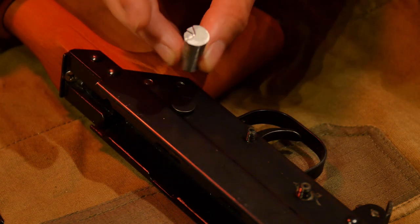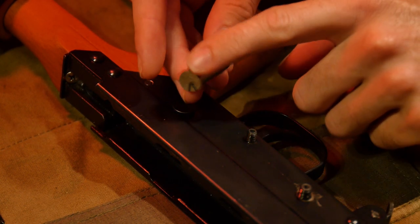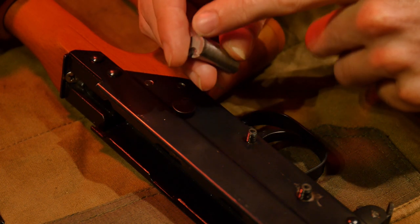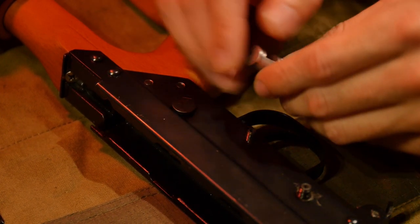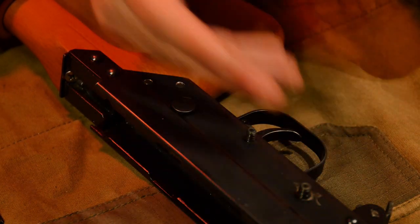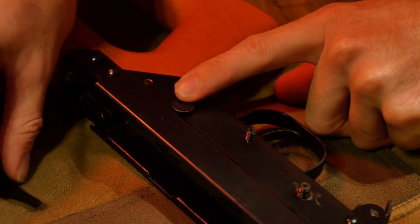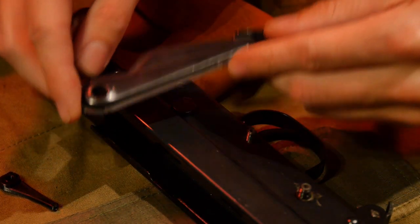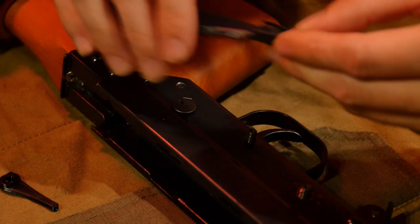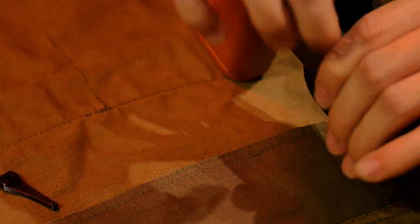That's what I've done on my Type 81 SR here. We're going to be switching to a prototype cam that I've been running on my SR for quite a while — and I'll show you the modification I did to it. I took my time and was able to remove the material in a way that makes it interlock with this radius perfectly, so my safety paddle only travels to the exact two positions and stops cold at those two positions regardless of the force applied.